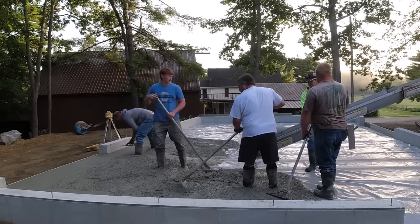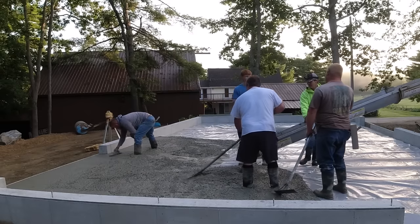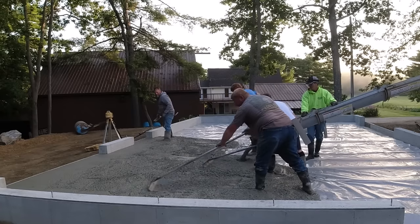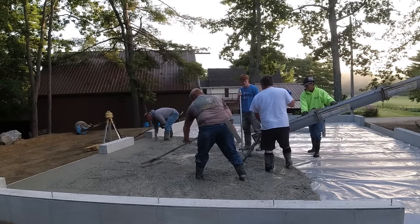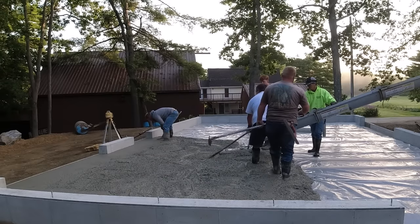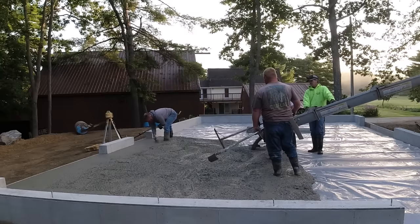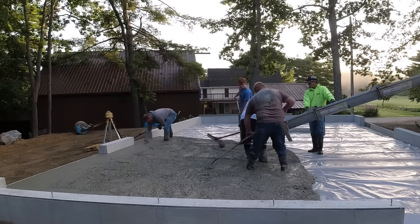I just want to show you what it takes to pour what I consider a basic simple garage floor — maybe a two-bay or three-bay garage. A couple loads of concrete here; this is generally around 14 yards of concrete at four inches thick, it's a little bit thicker in front of the garage doors. We can get about 10 and a half yards on our trucks up here in Maine on these rear dumps legally. We mostly use this company right here, Haley Concrete — they're really local to us.